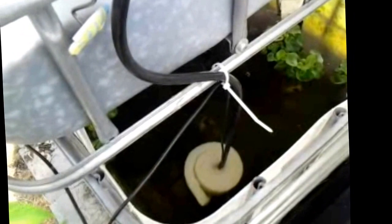This is the sort of pump that I'm running, and this is my spare. That's a lesson I learned early on — don't buy one pump, buy two. Because when that one fails, I can swap this one out without a problem. I don't have to go to a different size or a less than ideal pump. Pumps do fail, especially when they're under a constant duty cycle like I've got it wired now, where they never get a break unless I shut it off manually.